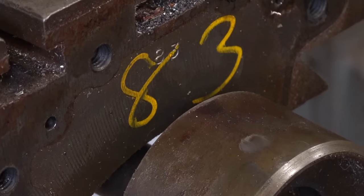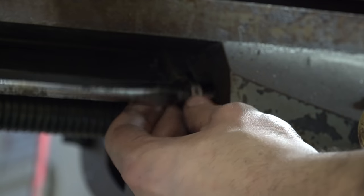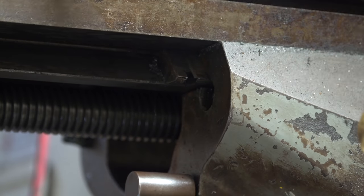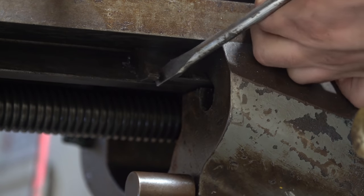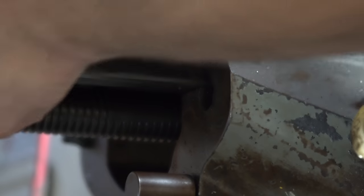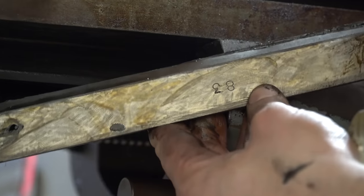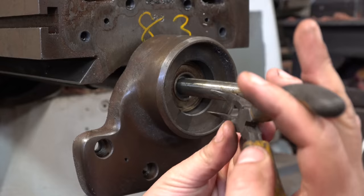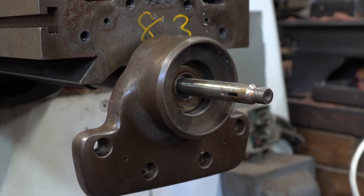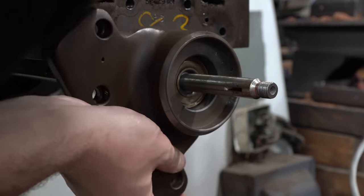Someone wrote '83' on there, and I think it was obviously from the factory. I haven't figured that out yet, but it's a part number or something like that placed all over the machine. The other gib on the other axis is very similar in terms of being filled with shims, slightly rusty, and filled with grease. I may need more shims or I may not — we'll get to that point when I reassemble and figure out what actually needs to be done to get accuracy back up to at least some respectable level.